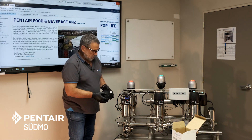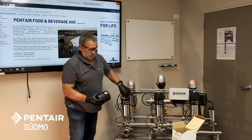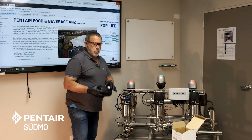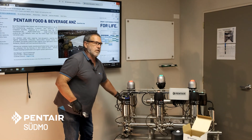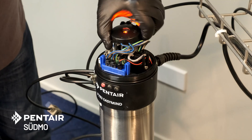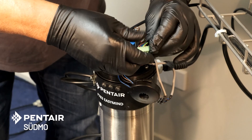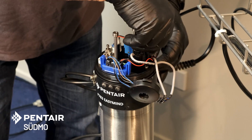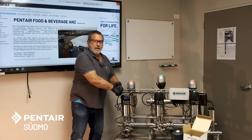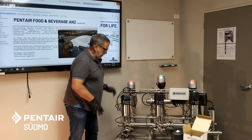It's got a PG-16 cable gland adapter in here that goes to the PG-9 cable gland. The reason we use PG-16 is because this power plug here fits through that hole. We'll first slacken the cable gland and then remove the adapter — just have to slacken the cable gland lock off a couple of turns and then the adapter will come out. I'll just take off the high-vis unit to make it a bit easier. Takes a little bit of wiggling but it does fit out. There's the plug — that can now be bagged up, covered, taped up and left sitting safe.